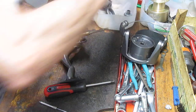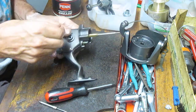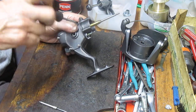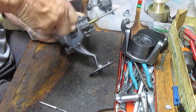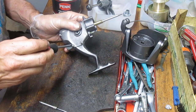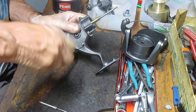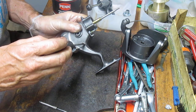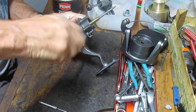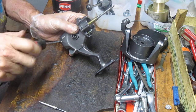Here's another reason the parts tray works so nicely — you can make sure all the pieces you took off are going back on and you didn't leave something behind. It's tough when you're working from memory and you suddenly realize there's a small spring or retaining clip that wasn't properly reset. Driving the side plate screws home — some folks have asked about using a mechanical screwdriver. I don't recommend it. If you must, use low speed and low torque, and stop short of the final turns to finish manually.